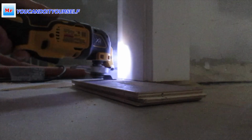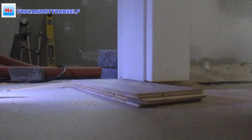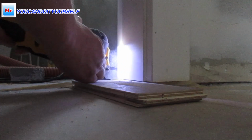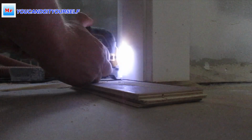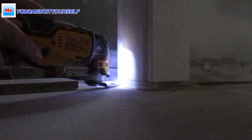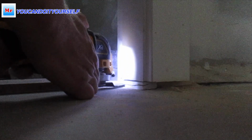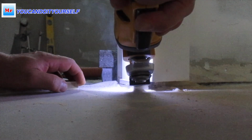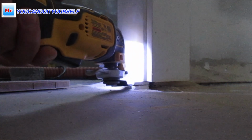If you're doing laminate floor installation or any floating floor installation, it will be the same material that I'm using for glue down engineered hardwood floor, laminate floor, or luxury vinyl planks. You also have to put underlayment under this little piece of wood, because when you cut the door jamb, it's going to be enough space for sliding this piece of wood and underlayment.